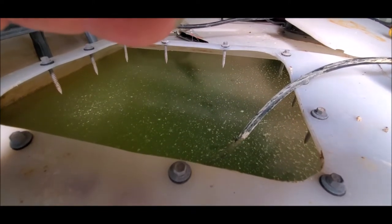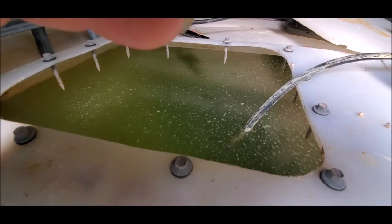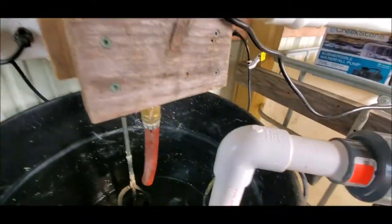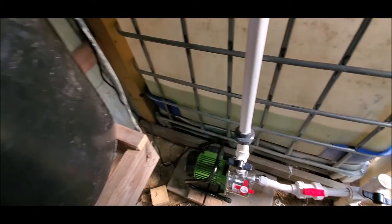I can only turn on one circulating pump because I don't have one in the number three tank right now. And we'll call that good by the time we walk over there. And that flushes all the chemical that was in the line. That flushes that line out. What we're going to do moving forward is do the fertilizer first, put it in the totes, and then turn around and fill it. That way we make sure we get all of it out.